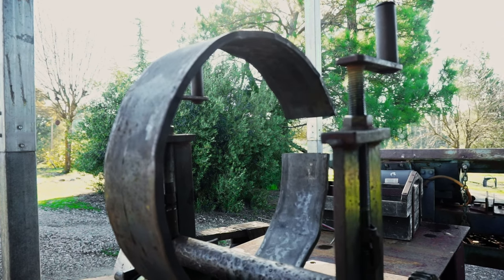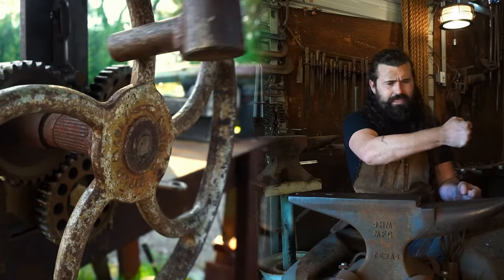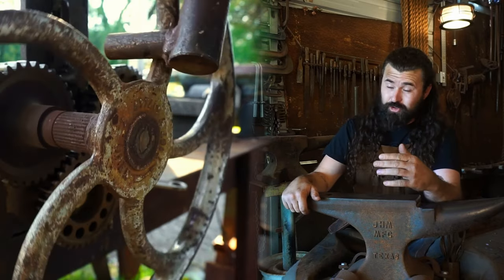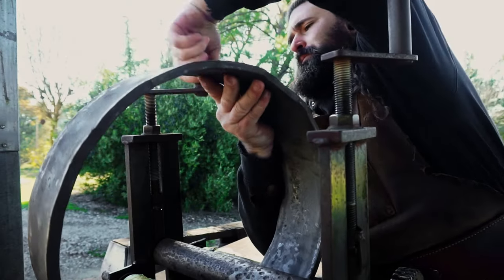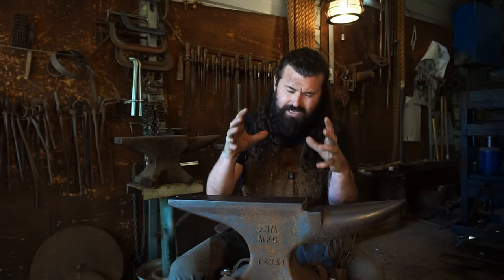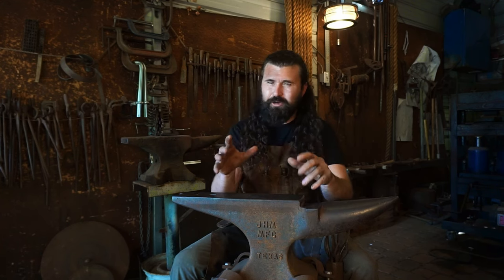When I'm working on material this thick — four by three-eighths — I can't just turn the wheel to make it happen. I actually have to grab what's called a snipe or a cheater bar to really bend that stuff because it's just so hard. You can imagine a lever as pretty much just a larger wheel. For the next roller I build, I'm going to build an absolutely massive gear reduction so I can sit there with a little wheel, bending massive bar nice and slow and steady.